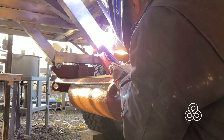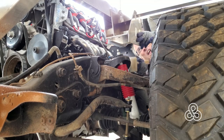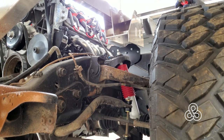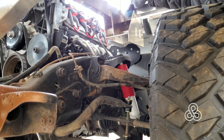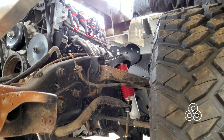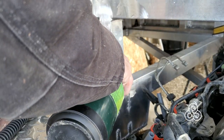Once we get these pivot points done we can move on to the rear. The rear was created with a bunch of gusseted plates, all slot-and-tab welded together. They will eventually bolt up, but they are first going to get welded around a couple of square tubings that intersect each other. Once we've pounded them around those tubes, we'll clean everything up nicely with a wire brush and acetone to get it ready to weld.